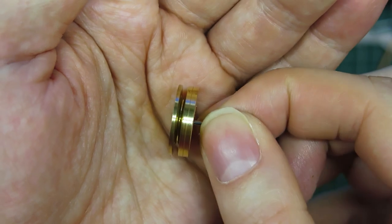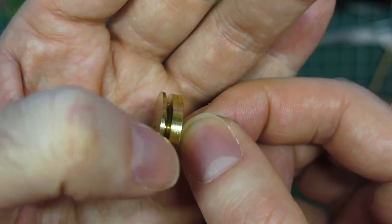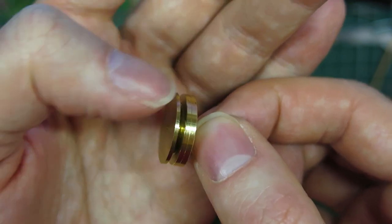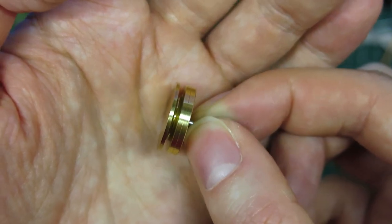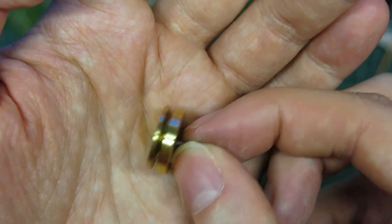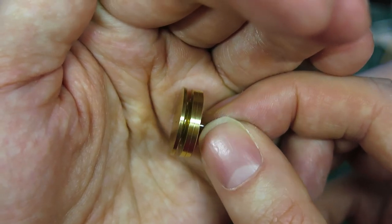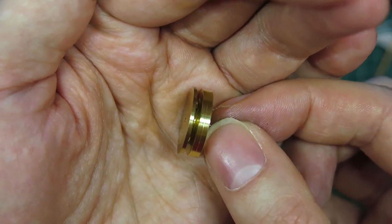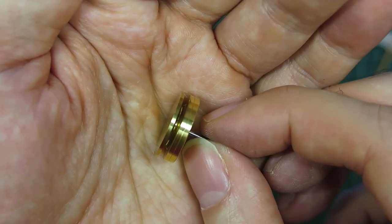If you've seen the last video I did on the Sanyo boombox, I noted that where the belt had melted, where it was in contact with the aluminium wheel, it had left an oxide on the aluminium where it had reacted with the metal. I noticed the same thing had happened here. There were green deposits left behind after the belt residue had been cleaned off. It just shows you that if you leave a belt long enough, or if it degrades to a certain state, it can actually react with metal surfaces. So I've noted this now on aluminium and brass.